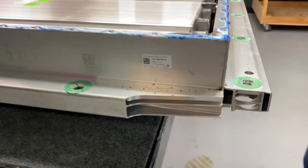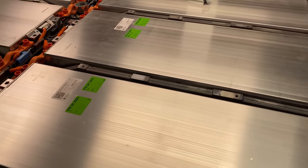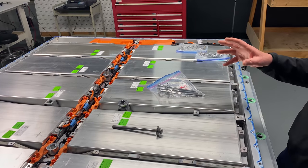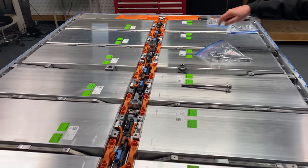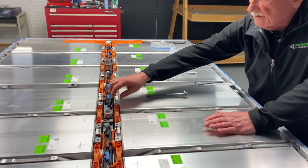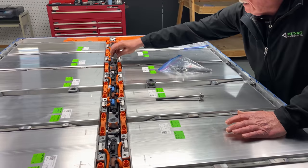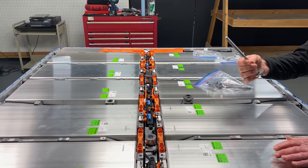You're also looking at some castings. This is one type of casting and you'll see it's welded to this extrusion and goes all the way across to the other side. This extrusion here is a little bit different — it goes from here to the other side, but it has some mounts that are a little bit different than the minor castings. If we look through the center, you're looking at an extrusion with these little extensions right here that are welded in place. Those extensions have two nuts — one on the top, one on the bottom — and this goes all the way through to the other side. Then you have one of these 8.8 bolts.